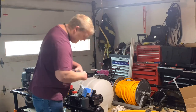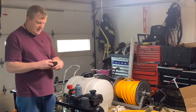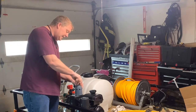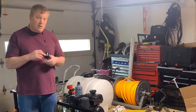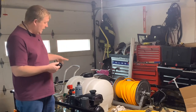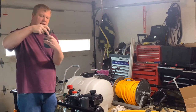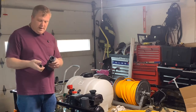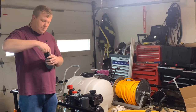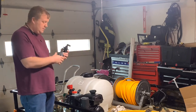What we're going to need is the Hudson float valve — that's the box there. Next we need a one-inch to one-inch NPT, which screws right in here. Then we need a one-inch bulkhead. I'll show you what I do to get as much water in there as I can — we actually stick it up in there with this sticking out. Then we have a one-inch to three-quarter-inch elbow, or three-quarter-inch barb, so the barb goes back through a filter and into our water hose.